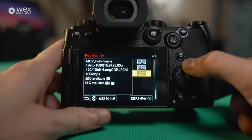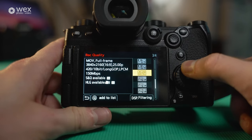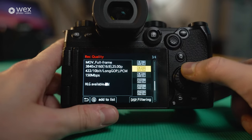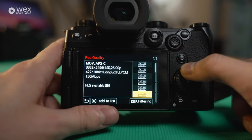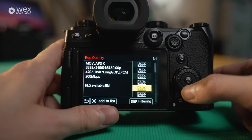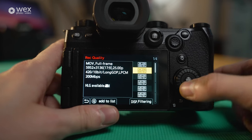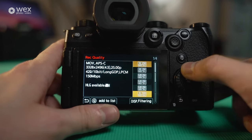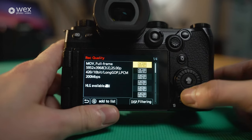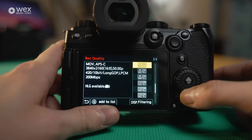You've got loads of options — you can go down to full HD 1080p if you want, whether it's to save card space or avoid processing 4K in your edit. You can also go up to 6K — well, 5.9K — and there's 3.3K for anamorphic shooting. So if you're using anamorphic lenses, this is really good for that. You've got so many resolutions all the way up to 6K, including Cine 4K as well as standard 4K UHD, in a mixture of 10-bit 420, 10-bit 422, and 8-bit.